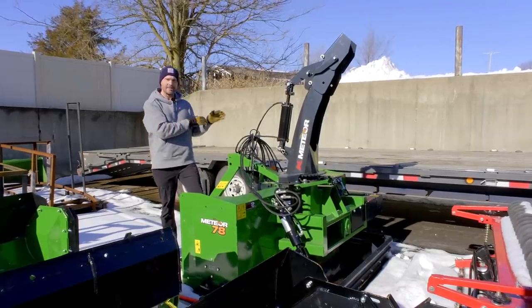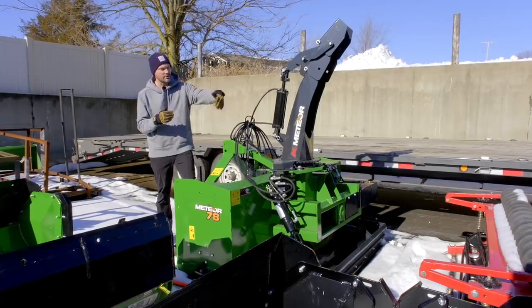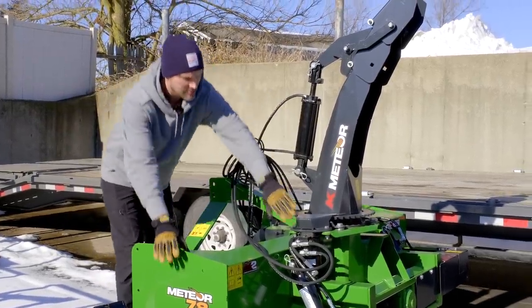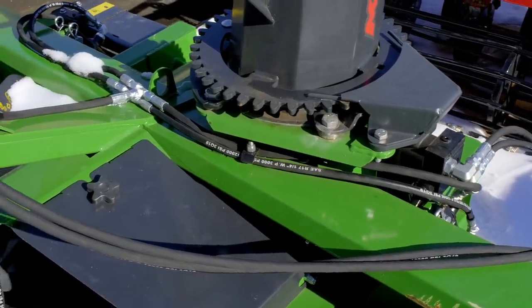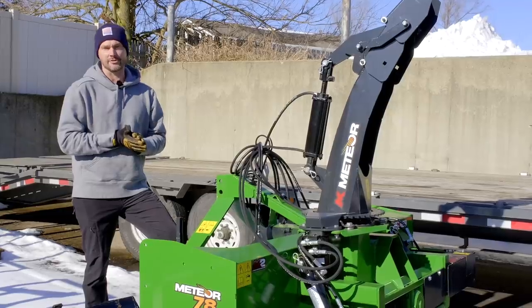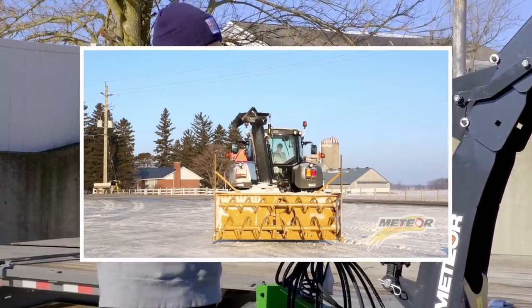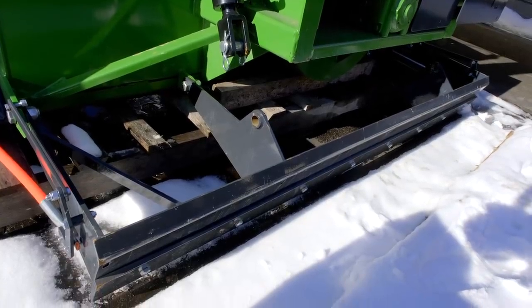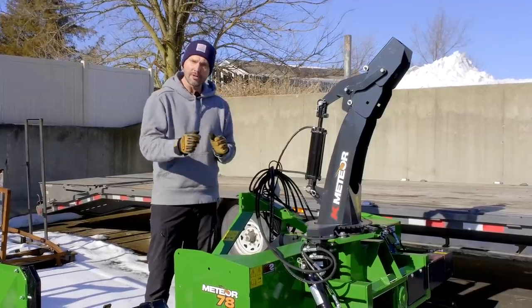Let's talk about snow blowers. If you have one mounted on the back of your tractor with your loader on, that ties up the first two SCVs or functions, so you need a third function to hydraulically rotate your chute. You can do it manually, but that gets old — and if you have a cab, that's a real pain. I've actually got one, two, three hydraulic functions on mine, meaning I need three additional circuits to run everything. Fortunately I have that on my tractor. Most snow blowers will have hydraulic chute rotation, but mine also has a hydraulic deflector to make it shoot up or further out, and a hydraulic backdrag to pull snow forward away from a building — all from the seat.